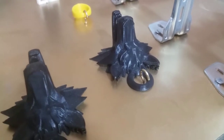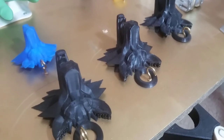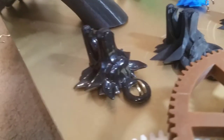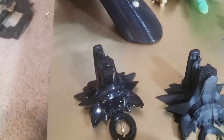An obvious place to start would be how to get the most out of your 3D printer. We will look at differences in layer heights and how to place the objects in different locations to get the most out of the speed of your print and cleanliness of it. These layers are very important to recognise because they are also the layers where the weaknesses are between the plastic and the breaking points, which you have to be aware of.